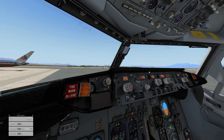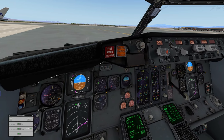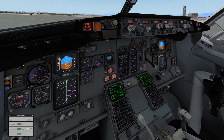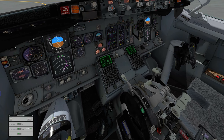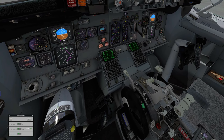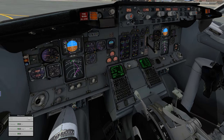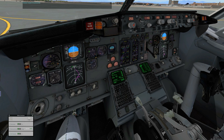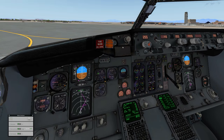I'll start right engine. And two. The oil pressure rise. And the N1 rotation is observed as well, so engine is not seized. I'm just waiting for 20%, 25%. Yes, now we're being pulled forward. Ignition. Pushback complete. Set parking brake. I got a cool start, it seems, as well. Starters cut out, and there we go, about 18 seconds on the other one as well.